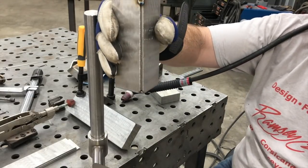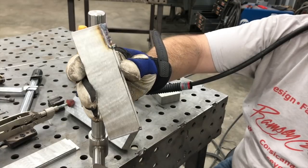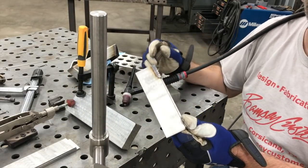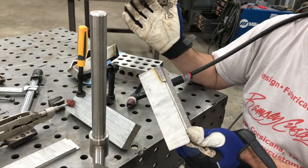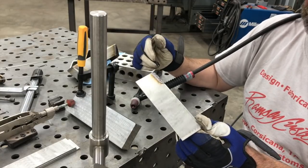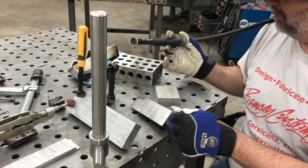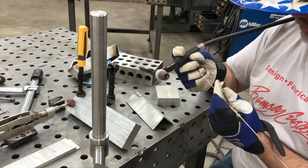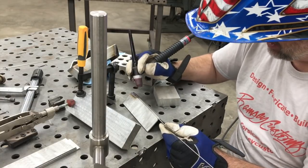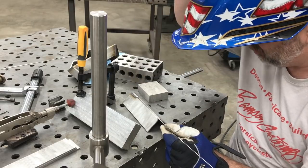That's kind of what I've been getting — it's not quite as dark as sometimes, but it's got that blackish hazed-over look. I've got the pedal set at 80 amps, just barely rocking onto it enough where it starts to fuse. With any less heat the puddle wouldn't wash forward — it would just lollygag and slow me down. What I'll do now is run a little more heat to pick up travel speed, and lay the wire in ahead so I'm not stopping to dab — just run right over it a little hotter.